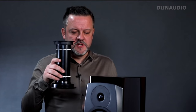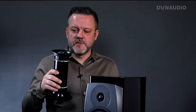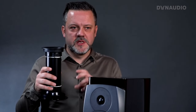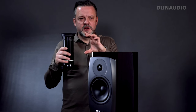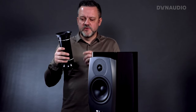This is the port of a Confidence 20 speaker. As you can see, it's a fairly large port compared to the size of the speaker. To understand what a port is or how it works, we have a separate video on bass ports you can look at. Briefly, the port functions as an organ pipe — it's tuned to a specific frequency defined by the length versus the diameter. A small diameter port needs a shorter length to reach a certain frequency; a large diameter port needs to be longer to reach the same frequency.